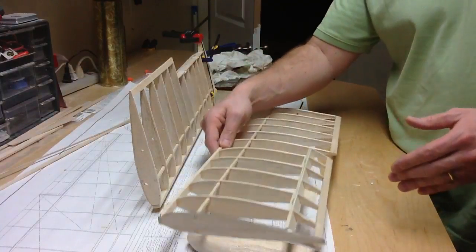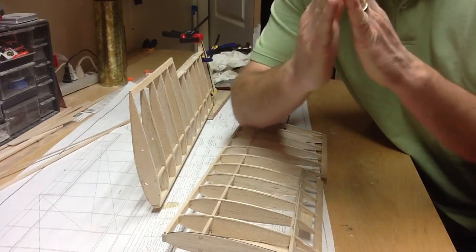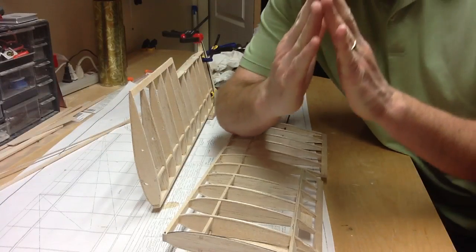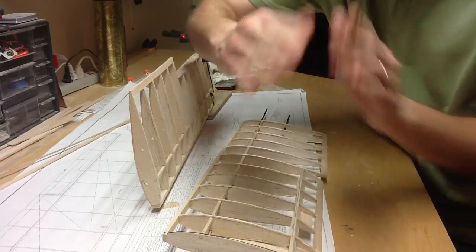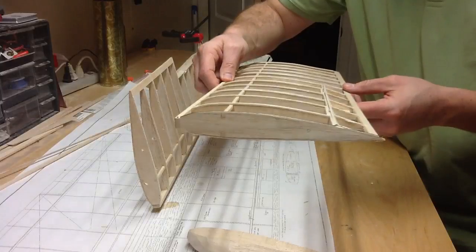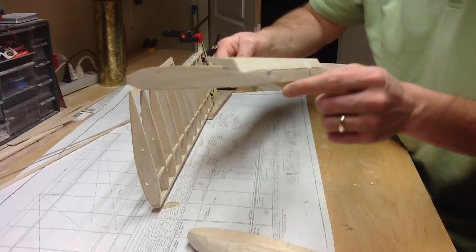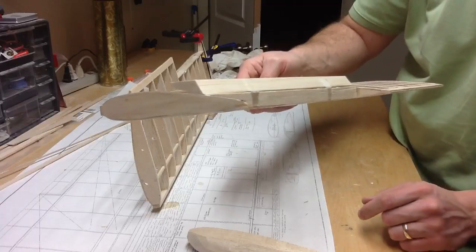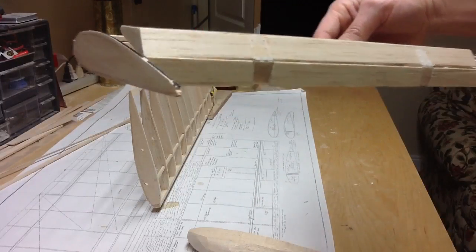Basically what I had to do is, the hinges don't want to lay flat - they kind of stop right there. So what you have to do is dig in this area to throw this hinge back. Because before I had it on there, that was about as far as they'd go down. So I dug out the bottom here, if you notice. You get a good view there - the bottom is dug out more than the top part is.